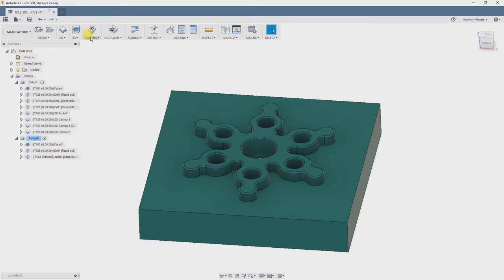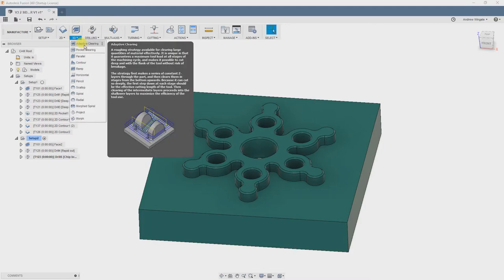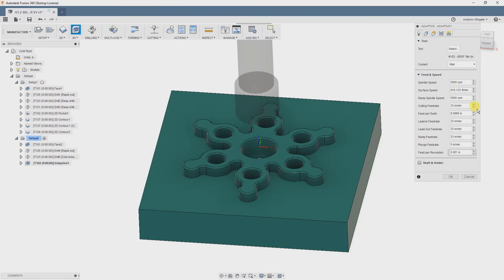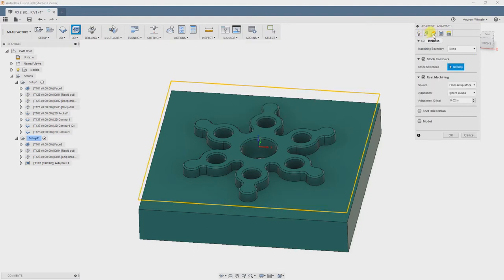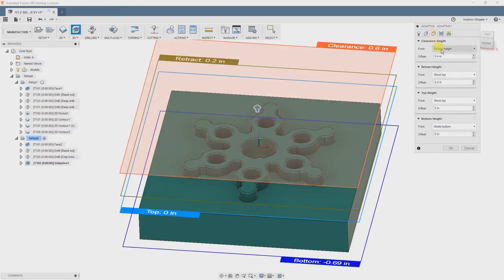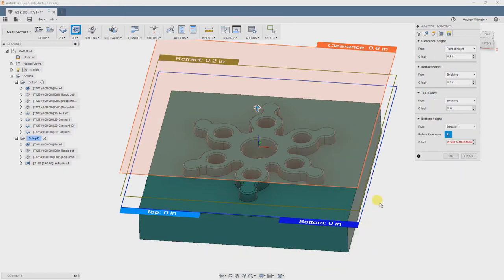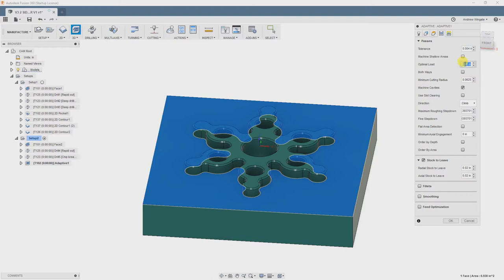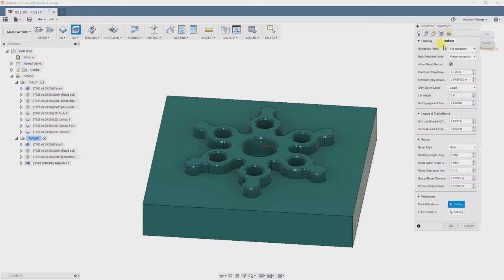So we've finished drilling our holes, and we're going to move on to machining out the logo on the front and rough that out. For this operation, we're going to choose the 3D Adaptive Strategy, and again we're going to be using the 5-8ths end mill. Speeds and feeds look good. Checking the Geometry tab and defining our heights — in this section, we're going to have to define our bottom height. If we don't select the face for the lowest point, it's just going to be predefined by our stepdown and probably isn't going to be where we want it to be. So we're going to choose Selection and select the face that is the bottom. Moving to the Passes tab, Optimal Load is what they call Stepover, so we get that value from our chart, same with Stepdown. We're going to leave 20 thou radially, but only 10 thou axially on our z-height because we're going to make a finishing pass for depth on our next operation. Click OK to generate toolpath — that looks pretty good.